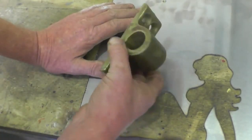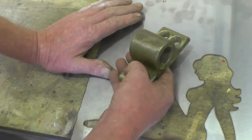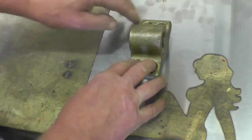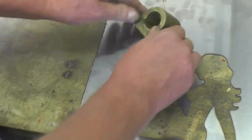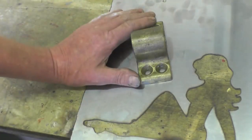I was asked by a friend if I can cast one of them using that as a pattern. It is possible — he only has one, and if he had more I would have made a proper pattern for it. What I need to do is fill all these wheels in and these body fillers, fill that wheel in as well, give it all a nice coat of body filler, and then sand it smooth.